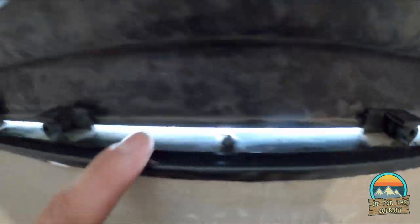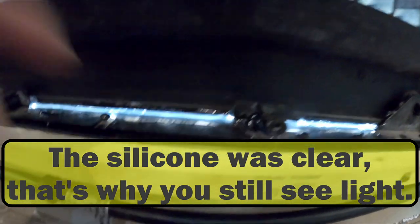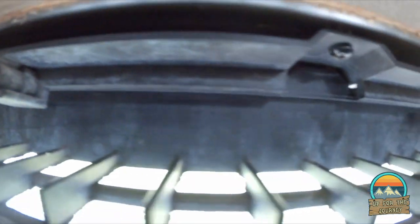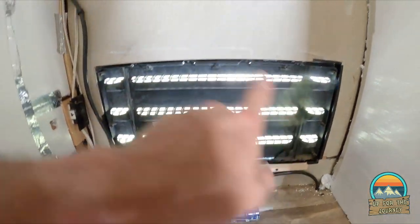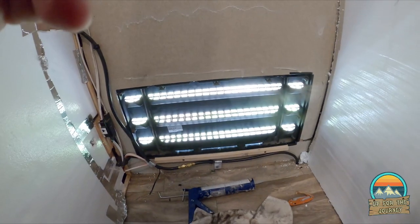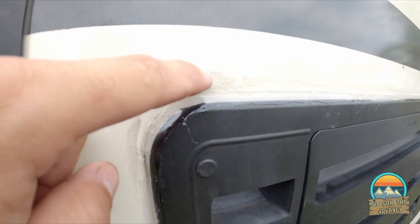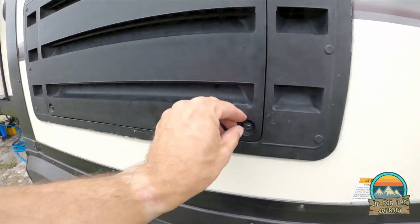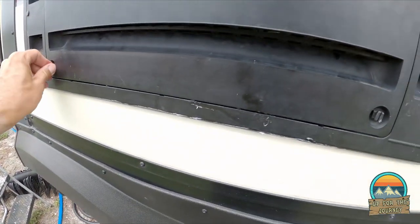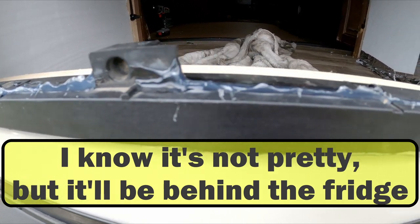I made a bead like a dam. You can still see light, but there's a huge bead of silicone — when you take the grate off there's actually just a wall of silicone stopping everything from coming in. The bottom hole was drilled out tighter than the top. Outside, I just gooped it all with caulking — it was way up here and now it's just sealed. That caulking dam stops all the water from going in.